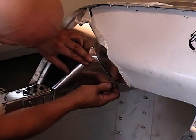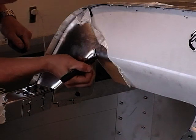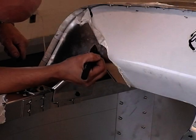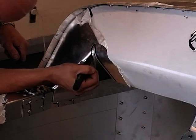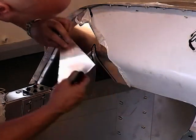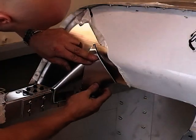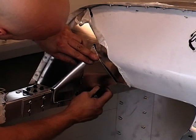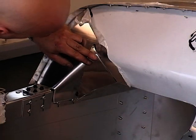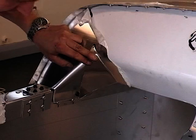So position your angle iron roughly to run a line down there for you, 6-7 millimetres in, all the way up. You see that's where your end line is roughly going to sit. So you get your hole about 10 millimetres up from that cutout there. Hold it in position, parallel. It's quite a complicated task to do. So once you've got it in position, you can see that the angle iron there is sat nice and tight.